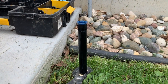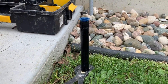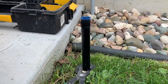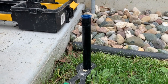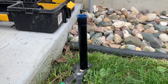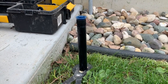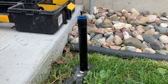This is a quick video tutorial on selecting the right nozzle for a Rainbird 1800 series spray head. Right now the homeowner has got a 10 variable nozzle installed — that means it's a 10-foot nozzle. Being variable, you can close it completely for no water output or open it up to a full 360. We know it's a 10 nozzle based on the blue color on top, but the homeowner is asking for a little more distance of throw.